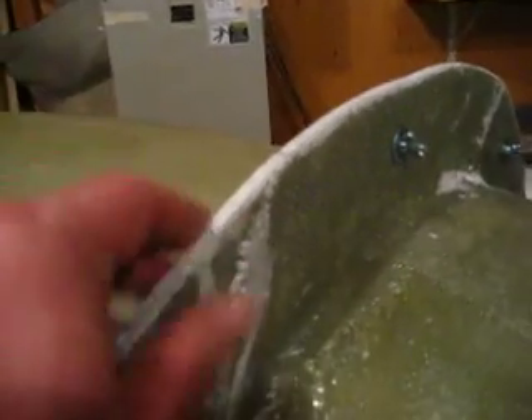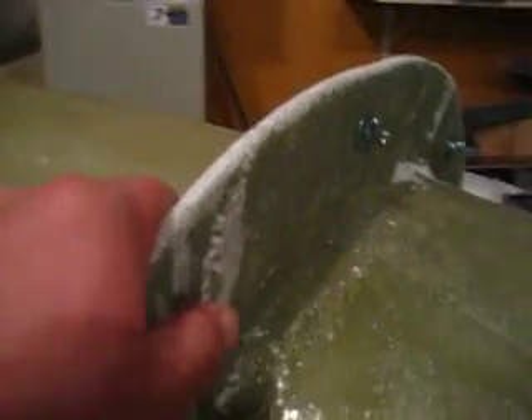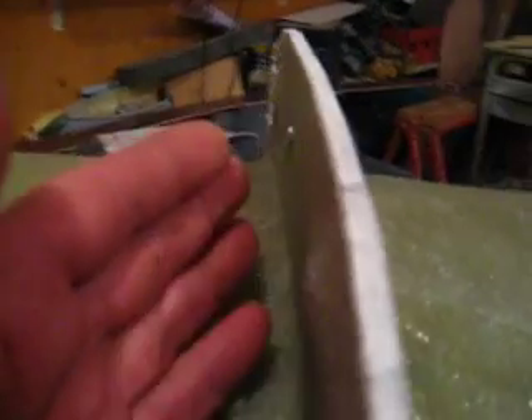So I got all my parting planes off and trimmed my edge — trimmed it with a jigsaw. I took my sander and went around this edge. Anything that's finished I went ahead and sanded. Got my sharp edges off and anything that might poke you. And bolted it together with my wing nuts. You have to do all your bolting before you take it off. I remembered my furniture slides that were on my parting plane, and I transferred them to one piece and then to another. So now I've got male and female planes that will interlock everything and make my seams come out perfect.